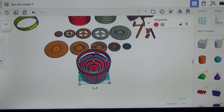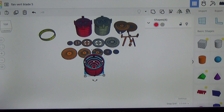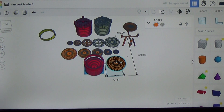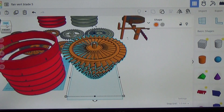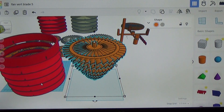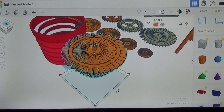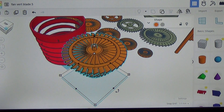Now let me grab one of the new designs so you can see what we've got. With the old design we had just five blades at the top interacting with all the air funneled up through the column. On this new rotor design, we've used basically the same blade pattern you'd see inside a turbojet engine — this outer ring design. I've also added another fan blade design into the center part of the very top one, so any air that bypasses the lower rotors still has a fan blade in the center to interact with and deliver torque.